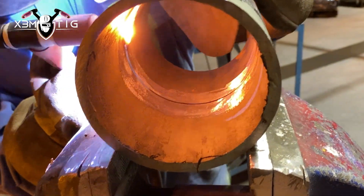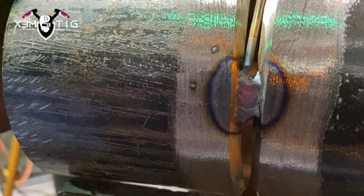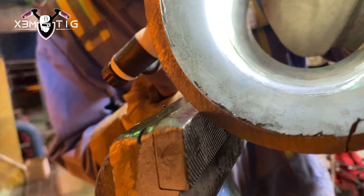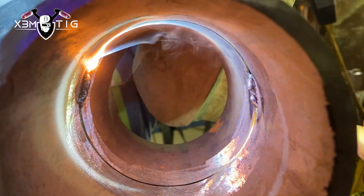You can see here he's a bit shaky and that's what reflects to your root. From the outside it's not that bad actually, but inside is what matters the most. He's now going to try to restart. I told him just to relax — he's too tight, that's why he's too shaky. You have to be relaxed, especially with the hand where you hold that torch and with that filler wire. That's a big delay — it's just the inclination burning the rod.